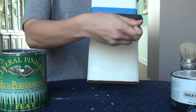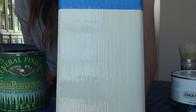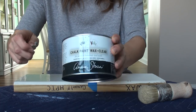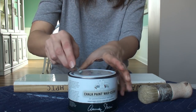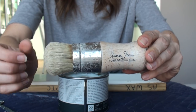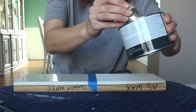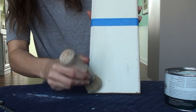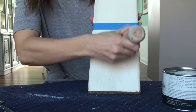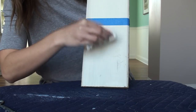You want to apply a thin layer. Once it's on it's pretty shiny and there are brush strokes, but those disappear a little when it dries down flat. Now moving on to the Annie Sloan chalk paint wax — this is one of my tried and trues, I've been using it for years. I'll link my other videos on this in the description. I'm grabbing my Annie Sloan wax brush, dipping it into the wax, and applying it to the board, going with the grain of the wood just like I did with the top coat. Then I use my same technique — taking a lint-free cloth with very light pressure to remove any excess wax.